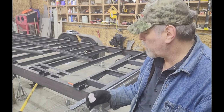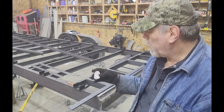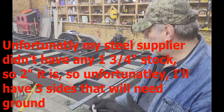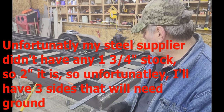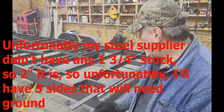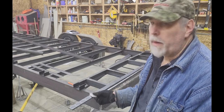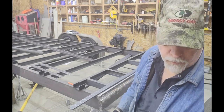I could put a metal blade on the vertical bandsaw, but it's three-eighths thick and the curves are pretty tight — I don't think I can make that tight a curve with it. So I scribed around the template with a silver paint pencil and I'll use that pencil thickness as the curve margin. I'll stack them together as one gang of pieces so when I grind and drill them they'll all be identical. I'm going to use the torch — maybe try the plasma — and get those cut out.